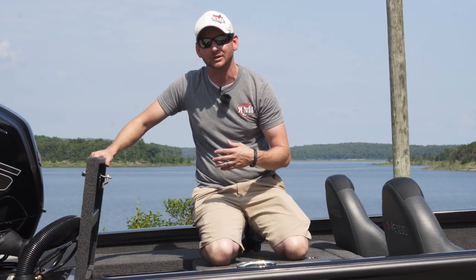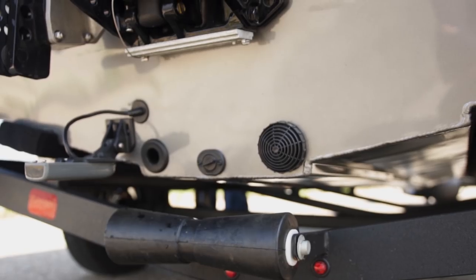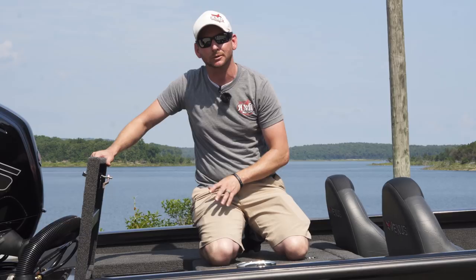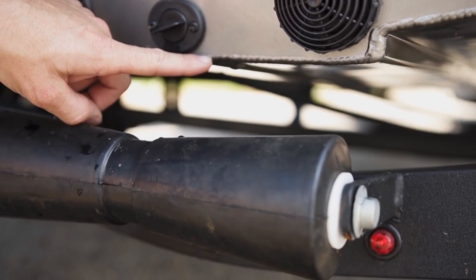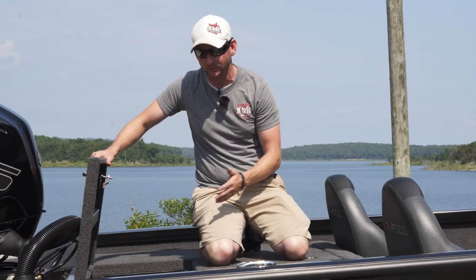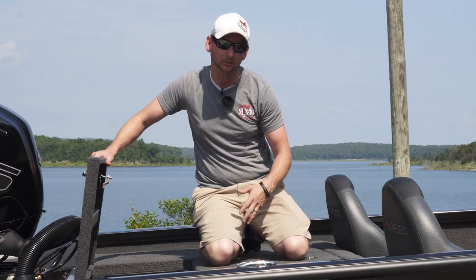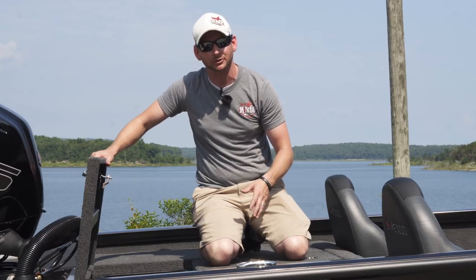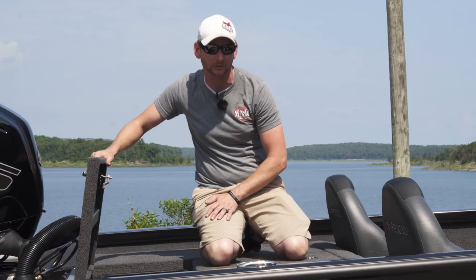One of the characteristics you're not going to see is that although this boat may look like several competitor boats on the market, the underneath side is completely different. This is an AVX high-performance hull — a pad hull. This is not a modified V. On a lot of modified Vs, by the time you get past the consoles further back you've got a flat-bottom-type boat versus a pad boat like this one. A flat-bottom boat is going to porpoise more and give you a rougher ride. This boat is going to be smoother, with that high-performance feel from the pad-style hull.